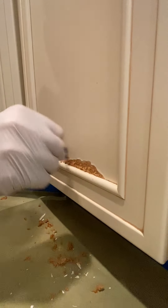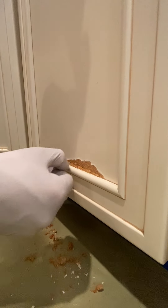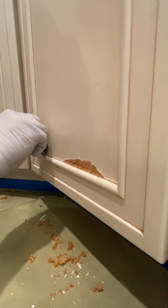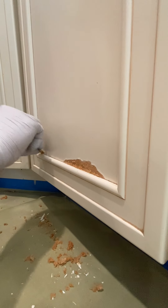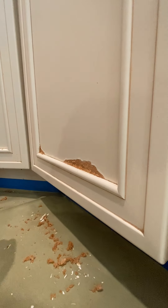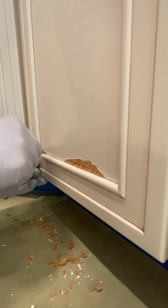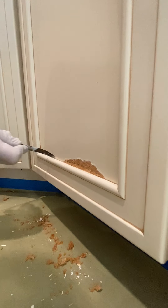The first thing I'm doing here is using a razor blade to scrape off the big blistering parts — get all the majority of the big stuff out of there without scraping into the MDF, because I don't want to create a dip inside the MDF panel. I want it to be nice and smooth. Making it as flush as possible is really important here. There's only so much you can do with the razor blade, so I'm going to take this little metal tool and flatten out what's there.